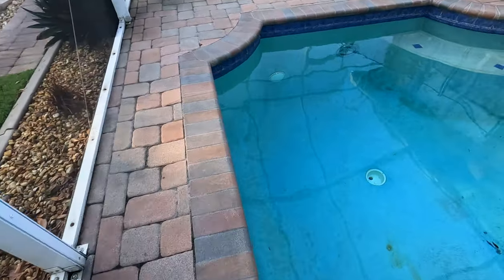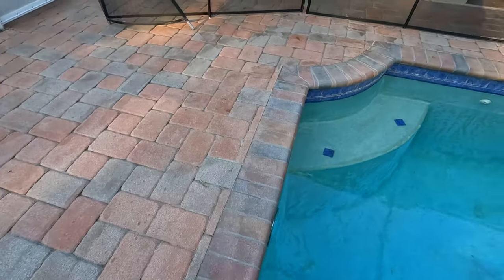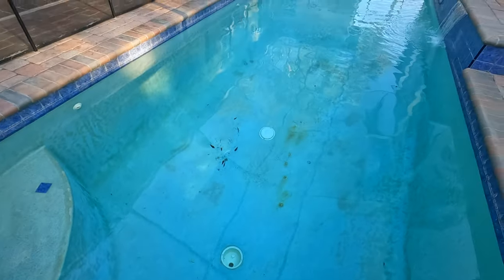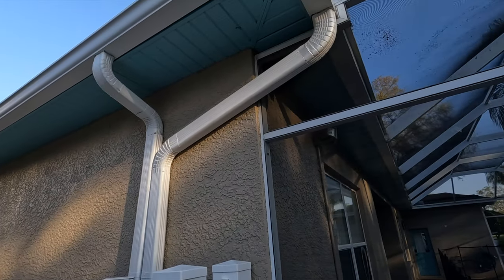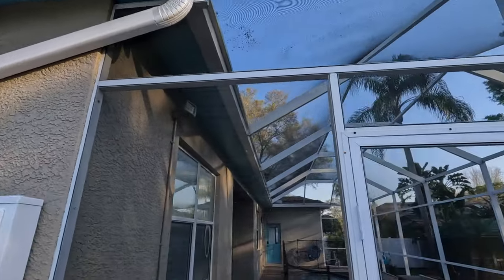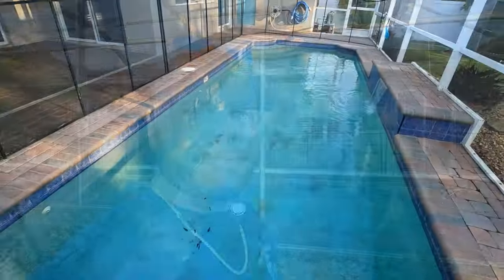At the end of the day I think this is a pool that's definitely manageable and fixable - I've seen a lot worse. We definitely need to get that drain cover fixed for safety. One other finding: I forgot to turn on the solar during the video, so I just turned it on - and you can clearly see this thing is losing massive amounts of water. That solar is not working properly, and the pool is going to be losing water while it's running. We'll shut that back off and note it in the report as bad.